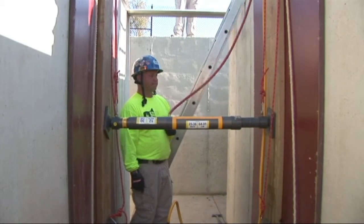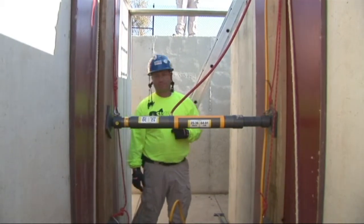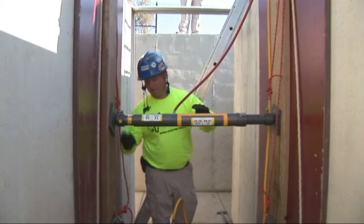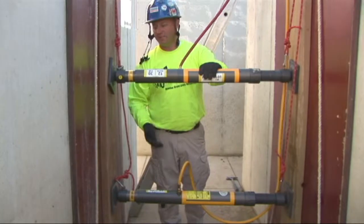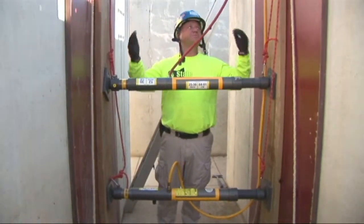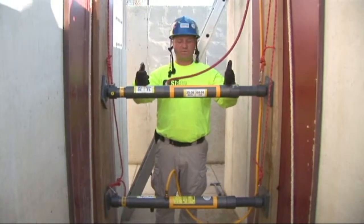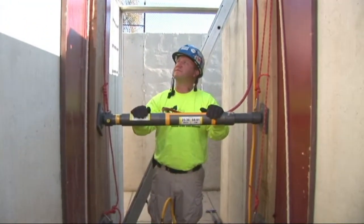You can see our spacing here. We're 24 inches from the bottom of the trench, well within our four-foot parameters from our bottom strut to our middle strut. We'll now install the top strut. The spacing between the middle strut and the top strut is the same — it has to be under the four-foot maximum.